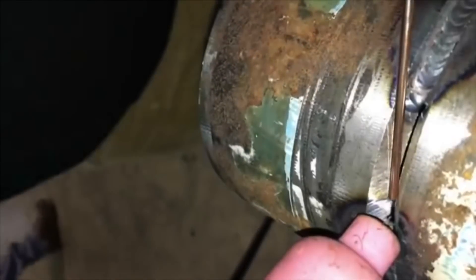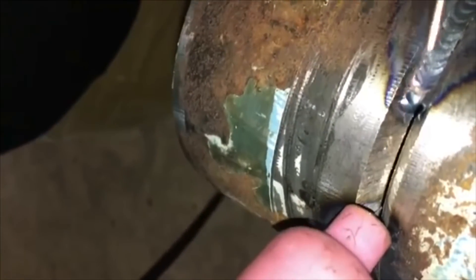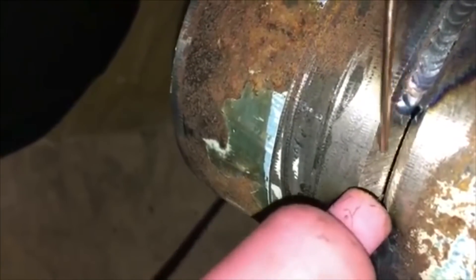Here's a video we did last year, and this is the same technique. You can see it's walking back and forth — add wire, walk it, add wire. So when you add the wire, you really want the tungsten to be still, because you're focusing that heat in one spot where you're adding the wire. And here it is dry washing — you can see it without the arc there.